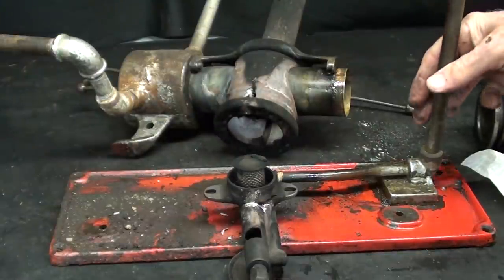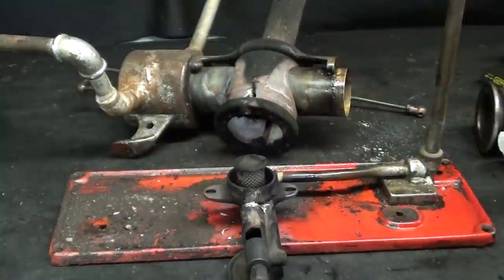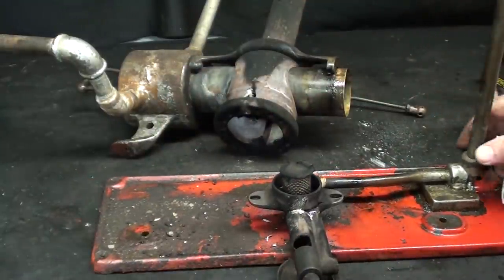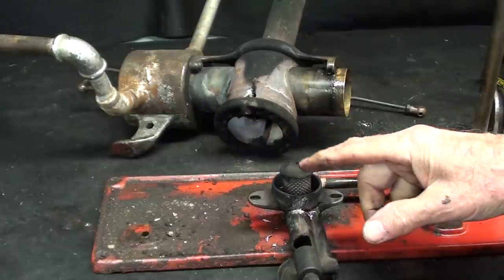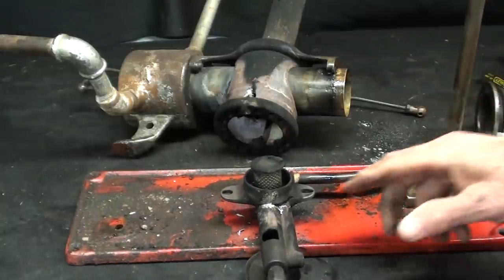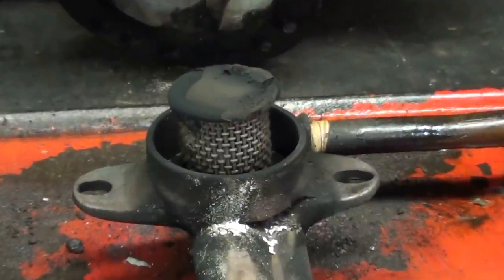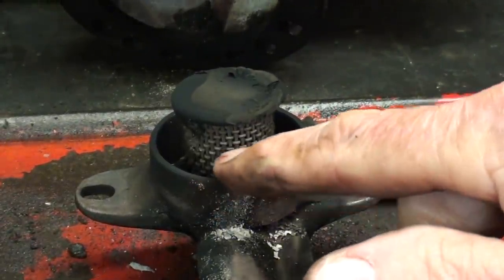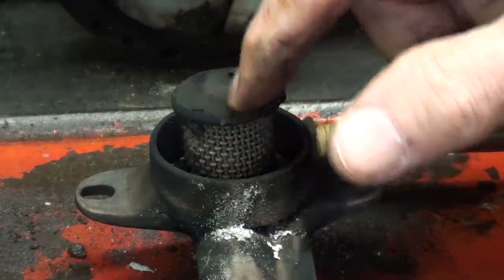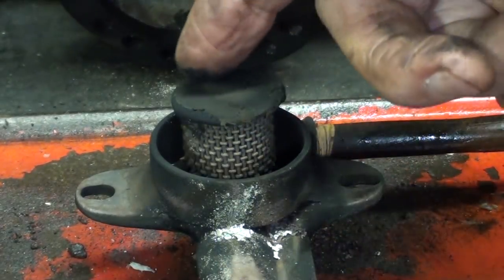While you went to the refrigerator I was working hard. I took the rest of the engine off the base — that screw was quite rusty because it was under the coolant area. Now I'm able to examine the burner more closely and see if that needs any attention. I had no idea it would look like that inside, but look at the soot. Many viewers said 'it's all sooted up' and you're right — there is no shortage of soot.